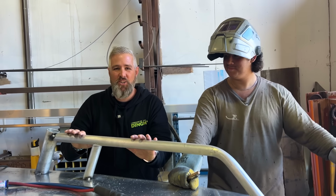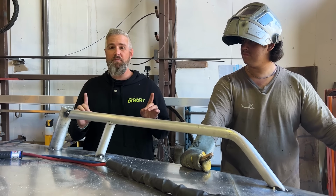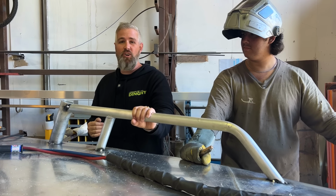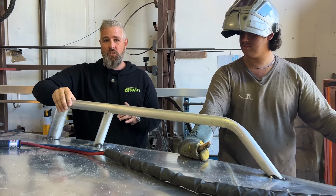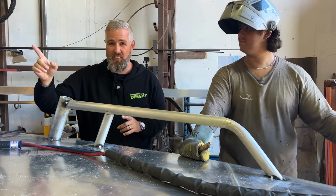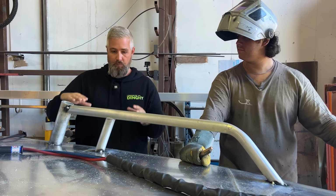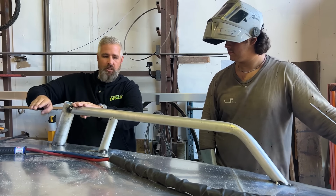So these are the new bow rails that we have going on. They're kind of unique. What we've got is we've got 2-inch pipes on the back and 1.25 inch actual grab rails. What we've done is this 2-inch pipe is gonna be the receiver for the footrest on the SkyHelm. So when I was talking to Sam, one of the things we're gonna pass on for production was we want to have a nice clean visual line finishing off the top of this pipe.